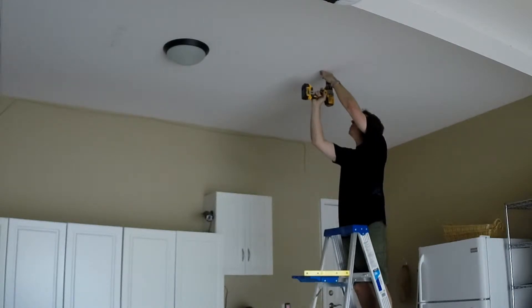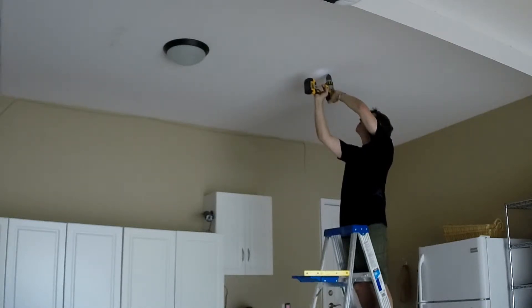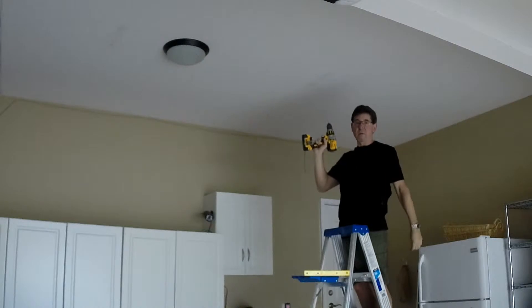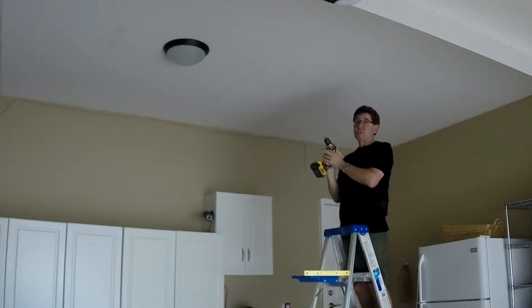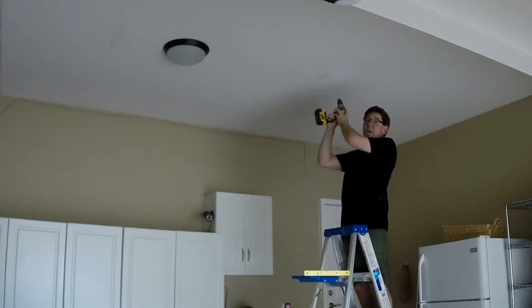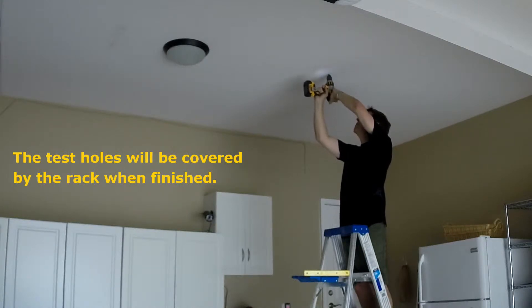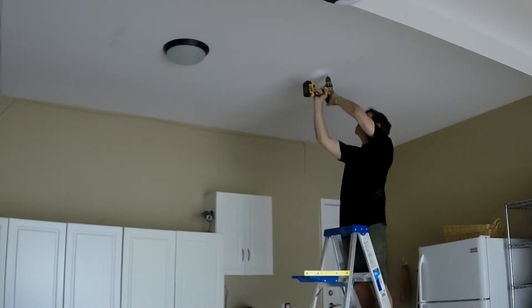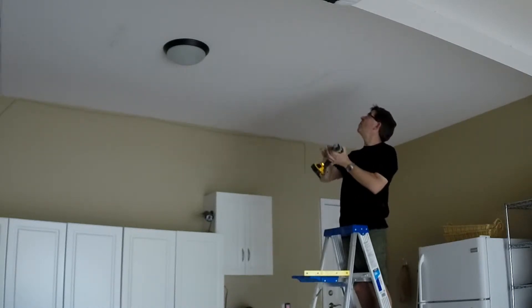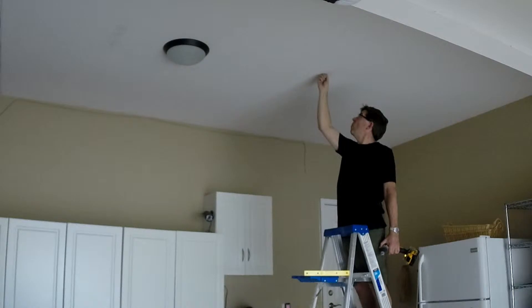So I've located my hole location and now I'm going to drill a hole to determine that I hit wood. The next important thing to do is see if I'm on the center of a stud or near an edge. So I'm going to move 3/8 of an inch this way and then 3/8 of an inch the other way and drill a test hole. In one case I missed wood, and in the other case I found wood. So I know that I can't totally trust my stud finder — it gets me close — but I have now determined where I want my initial hole.